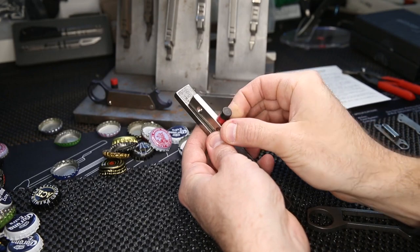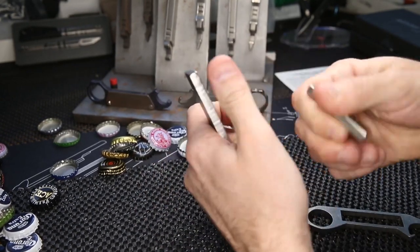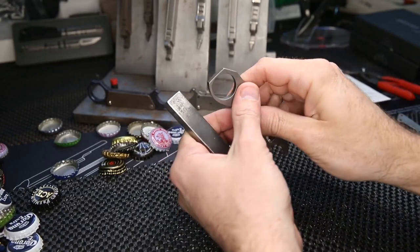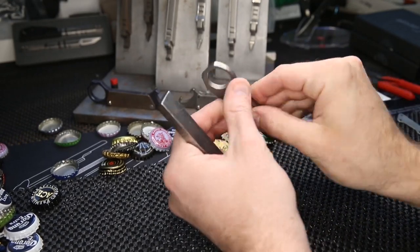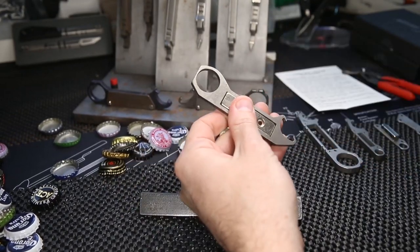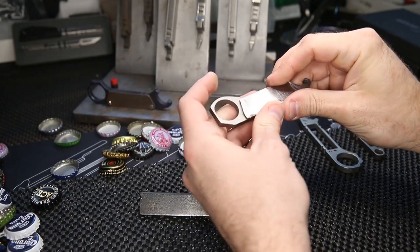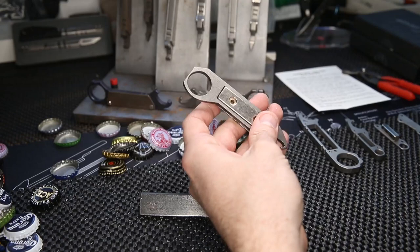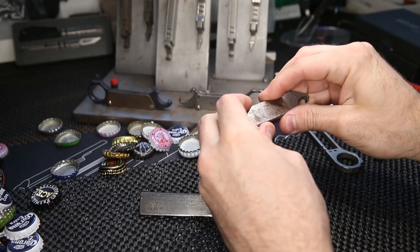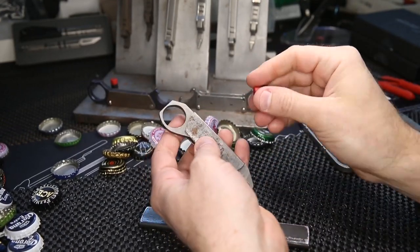The polarities are on the sides of the magnet, not on the edges. So the pull force is only on the sides, and when you place it inside it will not have enough strength to hold it to the surface. My solution was to take metal plates like a cabinet magnet and put them on the sides, which takes the pull force and projects it to those metal plates so that the magnetic force goes to the outside edges.